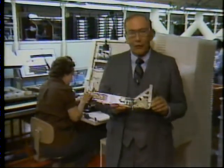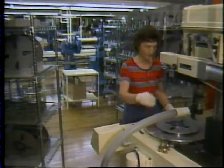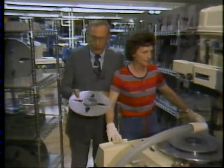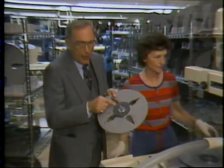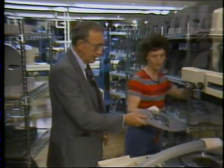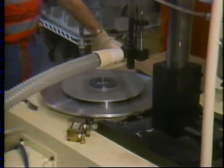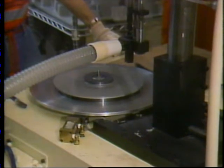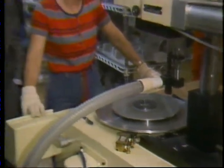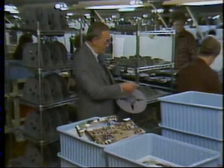The arm is now ready for final player assembly along with our master signal processing board. The player's direct drive turntable is the last major component that we need. This ring on the bottom of the turntable will actually become a component of the motor. The turntable must spin at precisely 450 revolutions per minute on a perfectly flat plane, so balance is critical. This operation dynamically checks and adjusts that balance. Our turntable is now ready to make its way to the final assembly line.